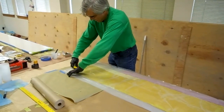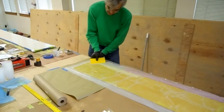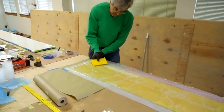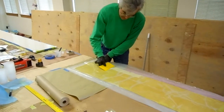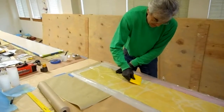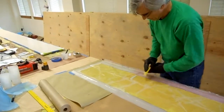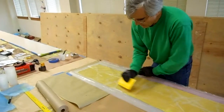We're vacuum bagging this at full vacuum basically — squeeze the hell out of it. You can't put too much vacuum on Rohacell; Rohacell is pretty tough. Whereas on the pink XPS foam we limit it to 15 inches of mercury, and on the white EPS we limit it to 5 inches because we don't want to crush it.